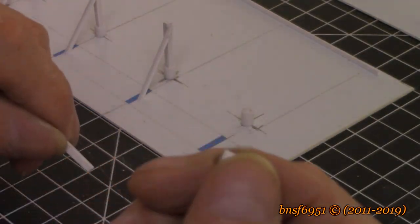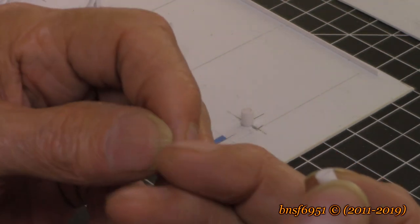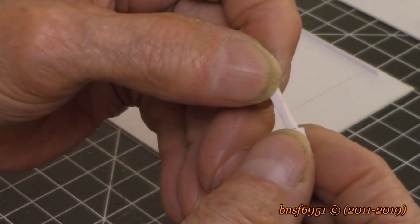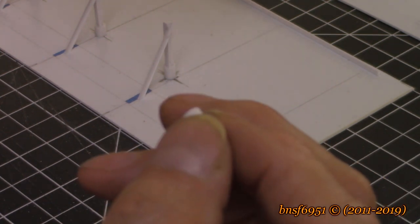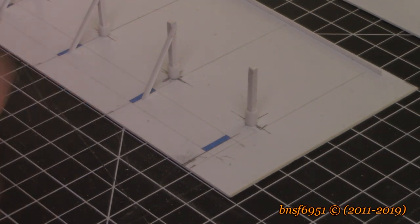As I showed you previously, the number 226 — 3/16th tube — and the number 175 work very well together as a footing and a steel tube. The footing is just over two feet in diameter and this is just over one foot. I know it sounds massive but it's going to be holding up a crane, so I thought to use some heavy steel. You can just take this and twist it on; it goes on pretty easily. I just shaved down the corners just a bit so it can go right in — that helps me make adjustments when I get it done.